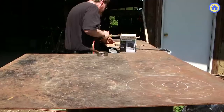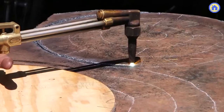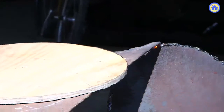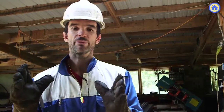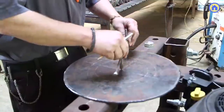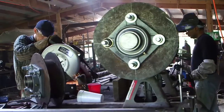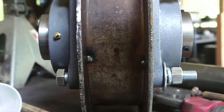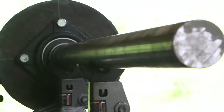The idlers are started by using quarter inch flat sheet steel out of which we cut discs. The disc is a circle and there are two discs per idler. There's a tube which is a 10 inch pipe that is the inside part of the idler upon which the track actually rolls. It's essentially like a wire spool — two pieces of quarter inch plate sandwiching a big 10 inch pipe which is about 10 and a half inches wide. That's the core of the idler.